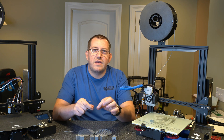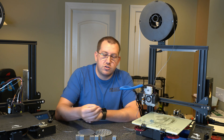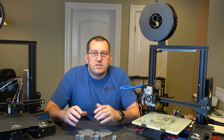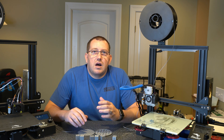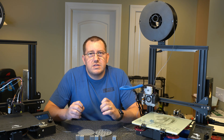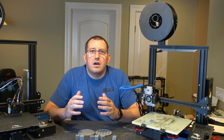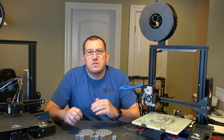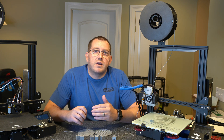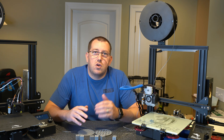I had a lot of cases where that same type of grinding happened — it's actually pretty common especially when you're trying to dial it in. I did get it to a point where I was able to make decent prints, but I keep going back to PLA most of the time so I didn't dial it in 100%. You'll probably have to make additional adjustments to your E-steps and flow rate to get this filament dialed in completely, but if you're going to be printing TPU quite a bit it might be worthwhile to know those numbers.